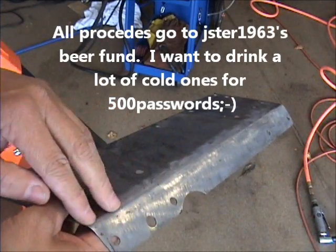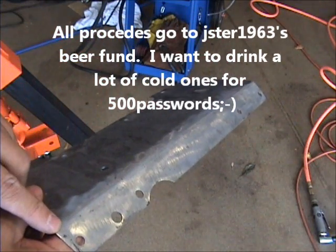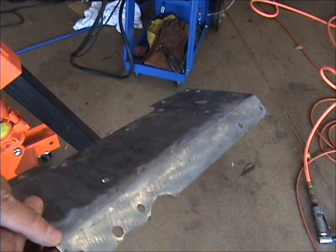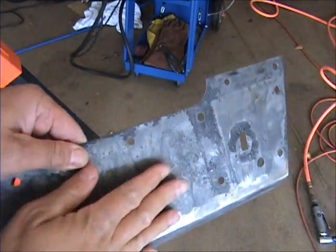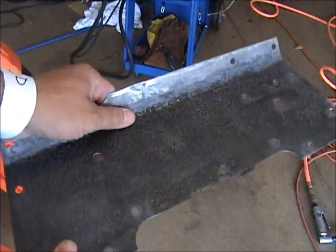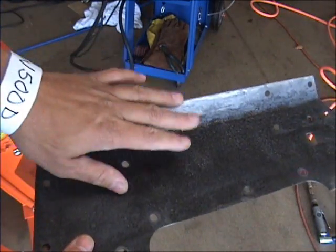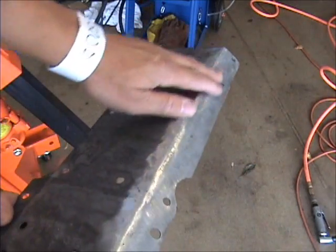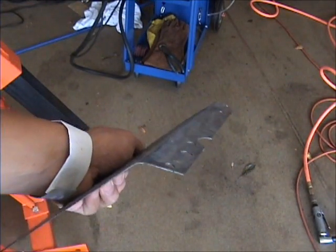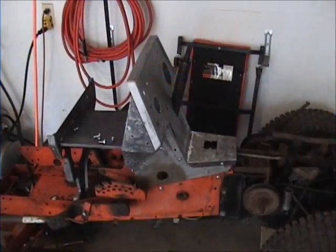So I went back and welded that in and got it sanded back down, put some phosphoric acid on. That's why the color's on there. That'll be taken all off when it's ready to put the body filler on it. Same on this side, but it's almost ready for filler. That's what I had to do on this piece. And now all the pieces are complete. Now I'm putting it together, and like I said, let's see if we can do a battery box.